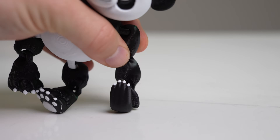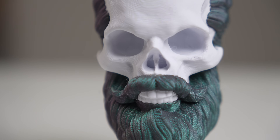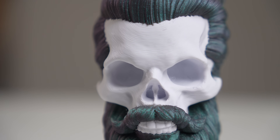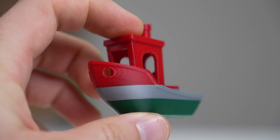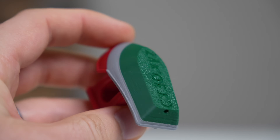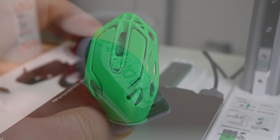The only thing I've noticed is that I feel like the spools on this unit load and unload slower than on the original AMS, which may be because Bambu doesn't want them flying off since they are external. However, when the AMS Lite is unloading and loading during filament swaps it doesn't have to travel back nearly as far as the original AMS unit, so I'm not actually convinced that it's any slower. Overall the experience with the A1 Mini and AMS Lite has been excellent, and I'm pretty blown away that the combo is going for $459.